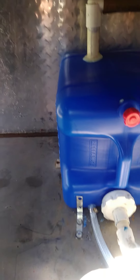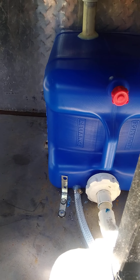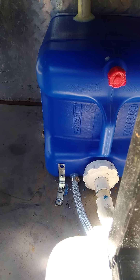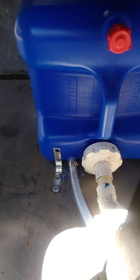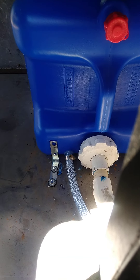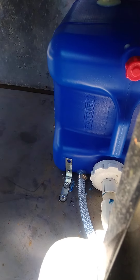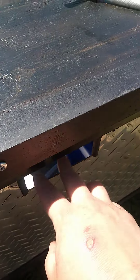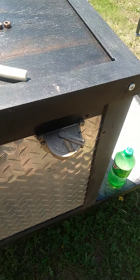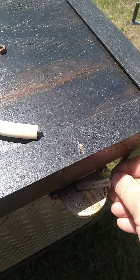That was a pain in the butt — going from copper to this other stuff. I literally had the guy at Home Depot say 'maybe y'all want to go shop at Lowe's.' We were trying to figure it out because you've got national pipe thread, you've got compression thread, it's all three-eighths but all different types of threads and connections. You have to cobble stuff together.